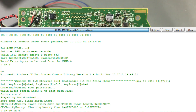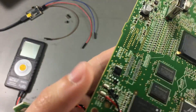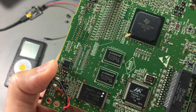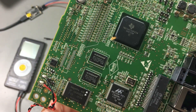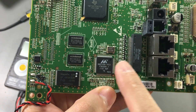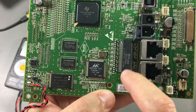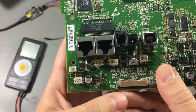It is clearly running Windows Embedded CE, which is loaded from this flash memory — a chip made by Hynix with a size of 2GB. Then we have these two chips from Winbond; they are DDR2 memory, each 128MB. Next we have a chip from Marvell, and judging by its close proximity to the ethernet ports, I'm guessing this is the Gigabit Ethernet switch. We can even see an integrated magnetics package placed between it and the RJ45 ports.